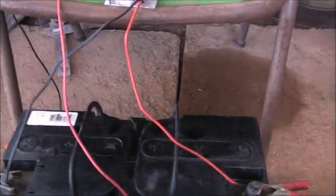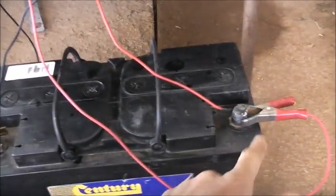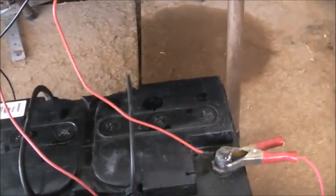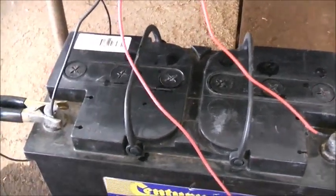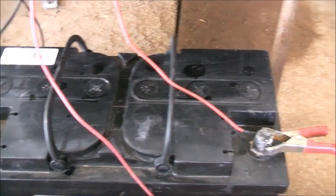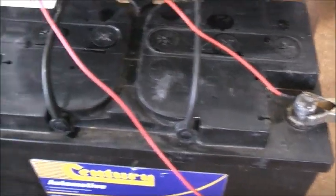Get out of here as well. I decided to give this batch a bit of a desulfate — just let it go over the whole weekend and see how it comes up. Before, off camera, I hooked up a capacitor bank to it and gave it a couple of really big pulses to try and see if that made any difference. Because basically what a desulfater does, some types just produce a pulse and put high energy pulses into the battery to try and break up the lead sulfate in the plates. So I tried that on my capacitor bank and some lead came off. The pulses may not have been big enough, but hopefully it's freed up some of the lead sulfation in those plates.